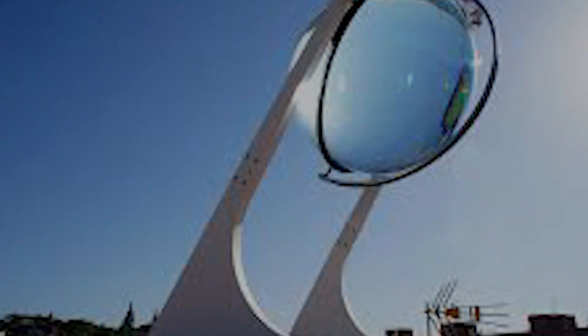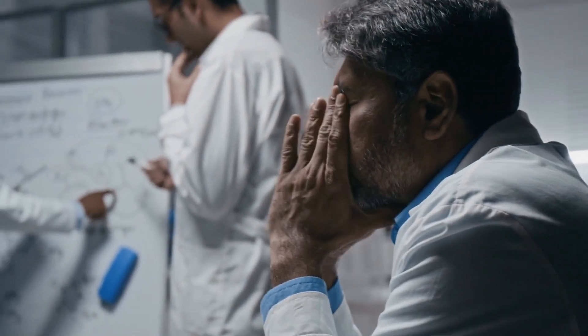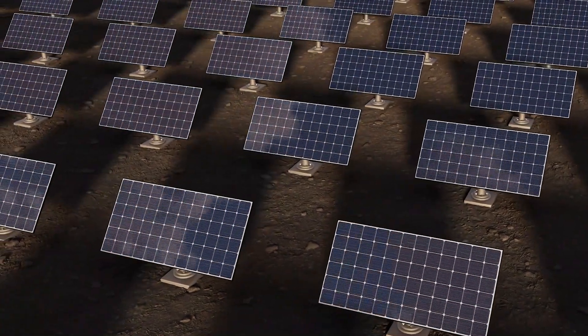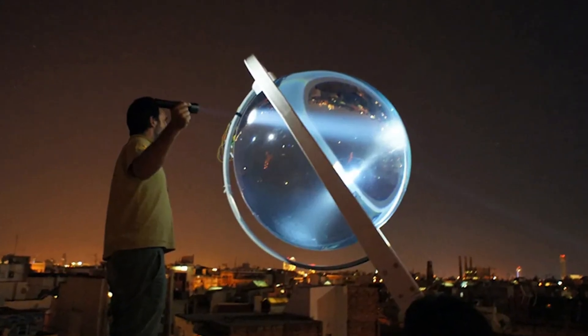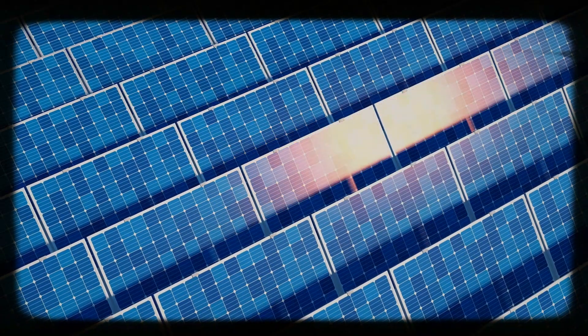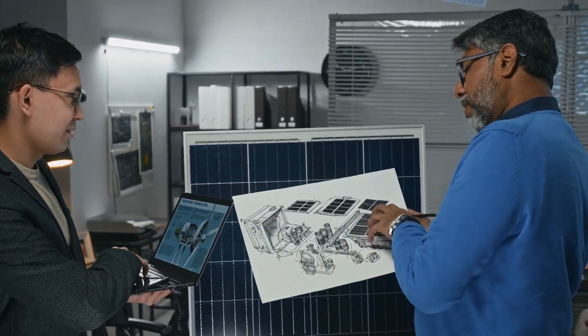You may have seen the glowing orb online — a crystal sphere hovering above a solar cell. It was called Beta. Its futuristic design raised over two hundred thousand dollars on Indiegogo, but it fizzled. The heavy glass lacked proper cooling, the small cell beneath wasn't built for focused light, and without a sun-tracking system efficiency collapsed. It looked like the future but worked like a prototype. A smaller desk version followed — more art than power — but the flaws remained. The issue wasn't just technical but conceptual: Beta turned energy into sculpture, but power systems demand reliability, efficiency, and endurance. Still, its popularity proved something — people want this to succeed. They just need a design that works.